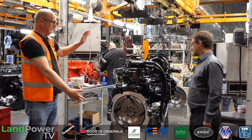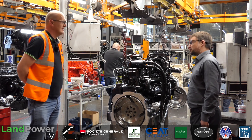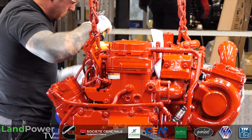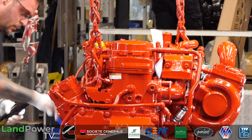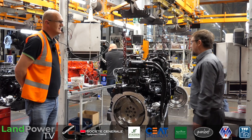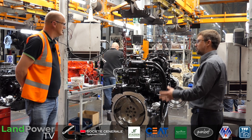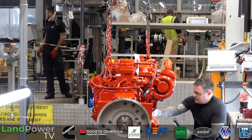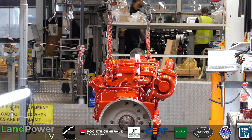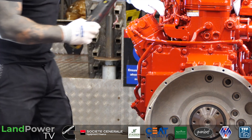It's looking like we've got a finished product here. This is a finished complete engine. The only couple of things left to happen: we do a couple of final checks. We hook it up to an ETS machine - an engine test stand - which connects to the ECM. We check all the sensors are still okay and make sure we don't have any fault codes after the paint process and washes. Then we go into a final inspection and audit, looking for any defects, paint damage, anything loose, anything that isn't where it should be.